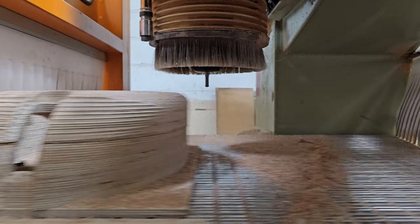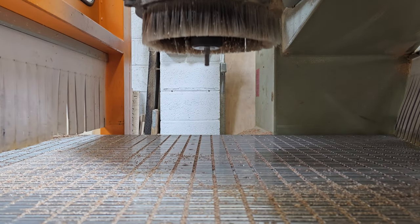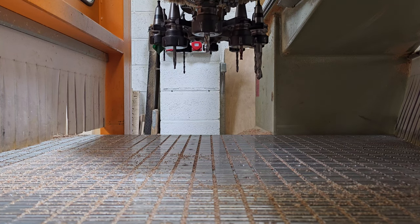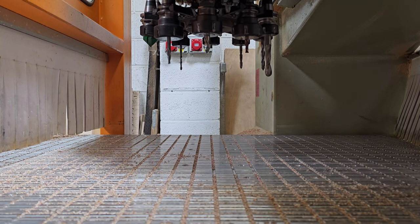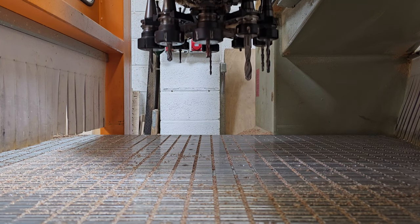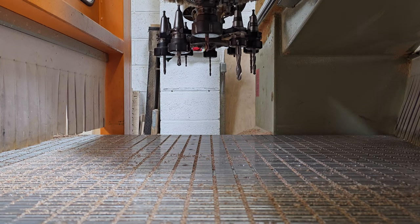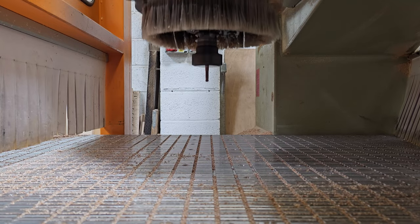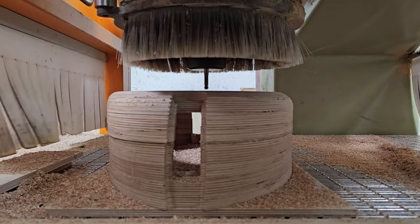Okay, so finishing up that, yep, it goes over there, it pretends to drill a hole. All that does is give me a G1 in one place so that I'm there, and it'll give me my M6 for my tool change before it does the next G0 to jump back over. So 8mm compression cutter. This is actually an Onsrud cutter, although this is the last one in the batch I've got of the Onsrud ones. After this, I'm switching back over to the EMST stuff.